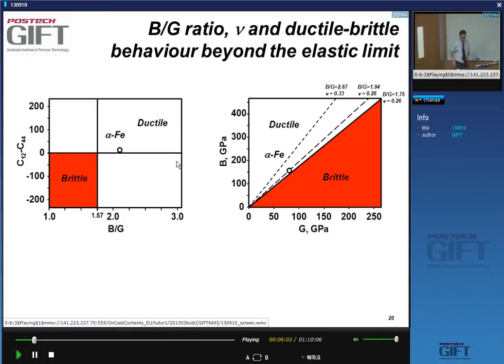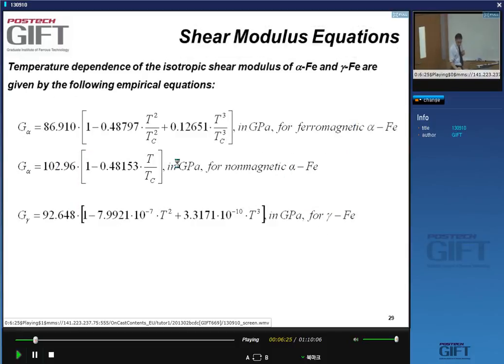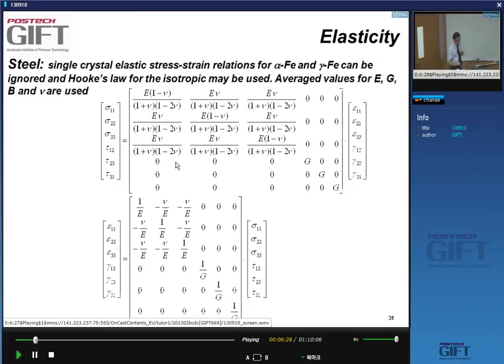and very ductile. The reason why it doesn't come out of this analysis is because we're looking only at elastic properties, and we should be looking at the properties of the things that cause plastic deformation, and those are the dislocations I already said. But before we go into this, I told you there were interesting equations which allowed you to calculate shear modulus as a function of temperature, as a function of composition,